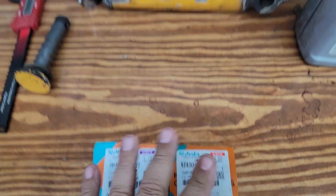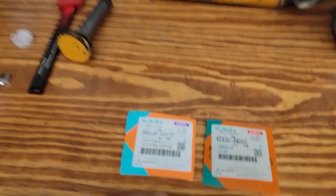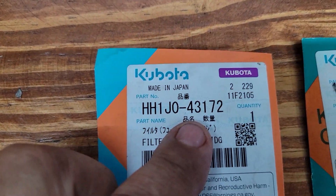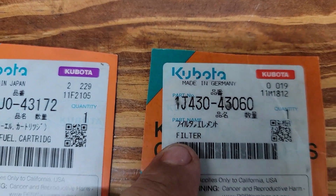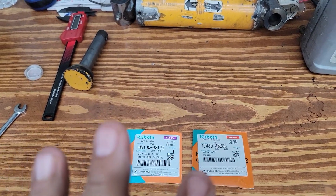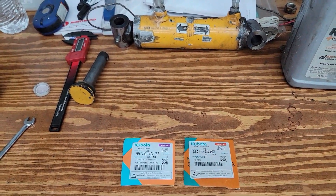If you have the filters as a spare, do it anyway — what's it going to hurt? I lay these out in the order they're on the machine. The German filter is the water separator. On the other side is the regular fuel filter from Kubota. They're both Kubota-supplied parts. There's your part number — where it says Kubota and made in Germany. And over here, there's the other part number — made in Japan, not China. So it's a filter and water separator, giving you dual filtration. I'll put both numbers in the description including a combo kit with knockoffs — I'm not saying you have to buy them, I buy the originals.